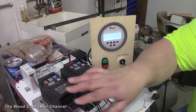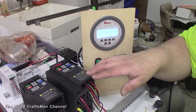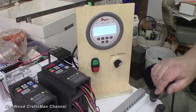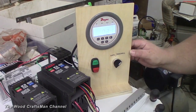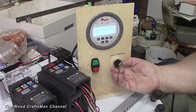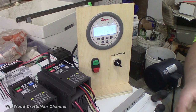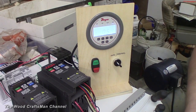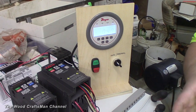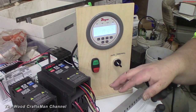I don't have this drive hooked up — I've got it powered off. The only things powered up are the 24-volt power supply for the Digihelic and the 2-horsepower drive. If I push the start button on manual — it's set at 30 hertz — the fan runs. If I switch to auto, you can see it's fluctuating based on how the manometer is measuring the static pressure within the room. It's pressurizing a room measuring against itself, so the reading is a bit confused, but I just wanted to show the concept.